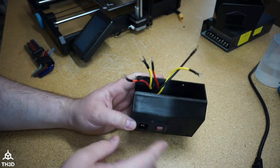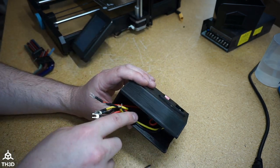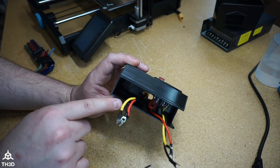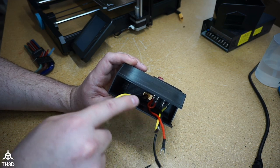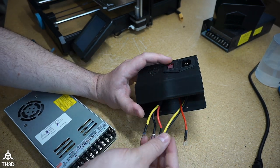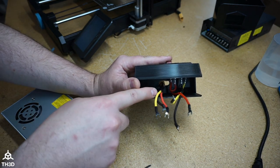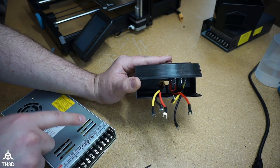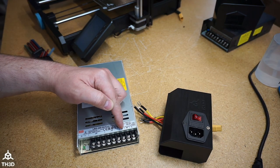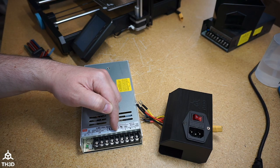Now we need to put the power supply in here. Make sure you have the wires correct — looking down you can see wires for the AC side and wires for the DC side. Do not get these mixed up — seriously, don't mix these up. The thinner wires are the AC lines and the thicker bundled wires are the DC lines. We're going to hook these up to the power supply on the new terminals — I'm unscrewing the Line, Neutral, and Ground screw terminals on the new power supply, as well as one V-plus and one V-minus terminal so I can slip the wires under.